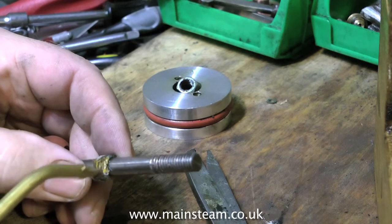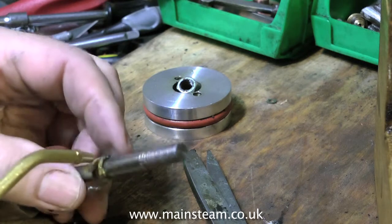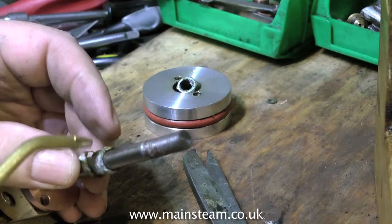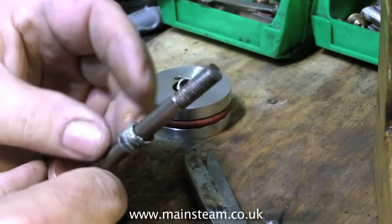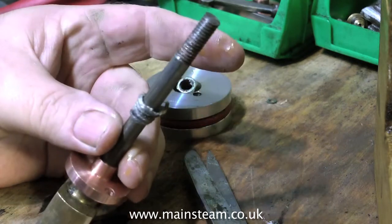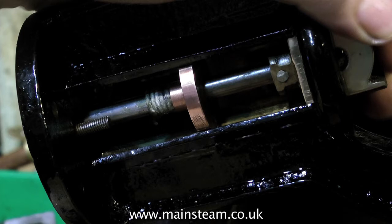It's not quite as graphite as it should be because it's unpicked from a much larger piece. What I would normally do is once I've wrapped the graphite yarn around the piston rod I would apply some steam oil. This serves two purposes: it holds the graphite yarn to the piston rod allowing easy insertion into the cylinder, and it gives a head start on the lubrication. It's also much more difficult to wrap the graphite yarn when the rod is fitted inside the crosshead guides.